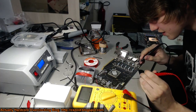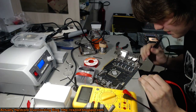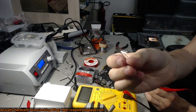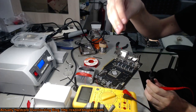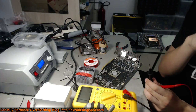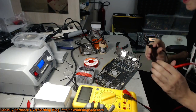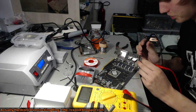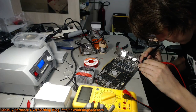What's nice here is the traces from this controller actually go pretty far out. So when we're cutting the power limiters, I think they're all on the same side. You're going to need something like a push pin - just scrape through the traces when you're cutting things out. Or if you can trace the trace to a resistor, you can just crush the resistor, and that usually works - you have to check where the resistor leads. I tried doing that with the R9 290X - if you go to my blog, the first thing is the R9 290X Frankenstein. I crushed a bunch of resistors and found out it didn't work because the controller was really smart on that card.